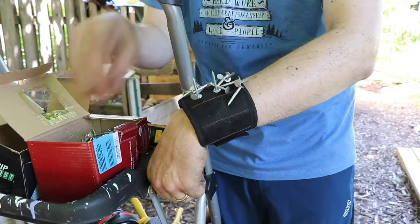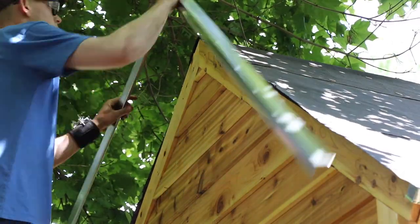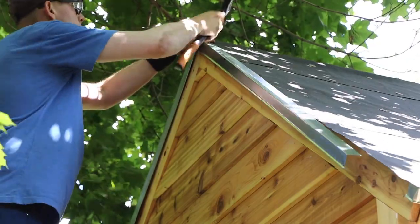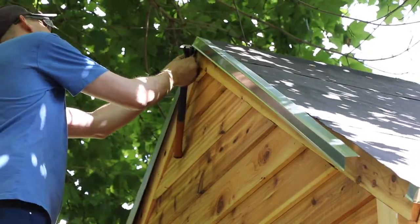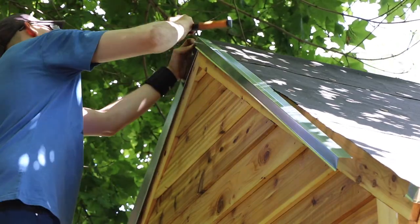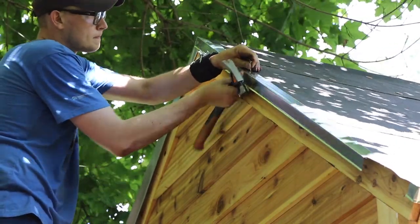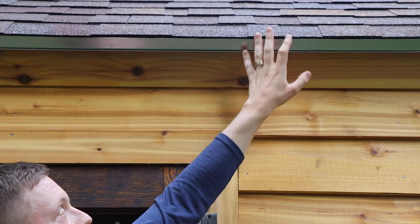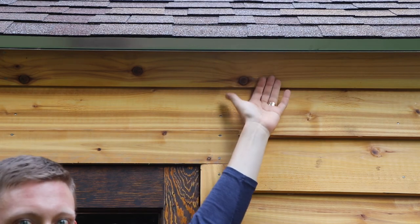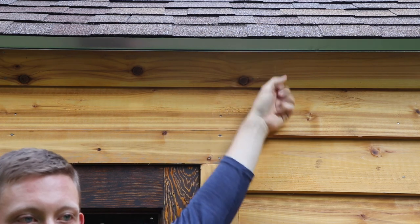This is really easy — just using roofing nails to pound it down every foot. An important thing to remember: don't put the drip edge right along the fascia. There's a lot of conflicting information out there on YouTube and websites. I opted to go with keeping the drip edge away from the fascia by at least a finger length, because with a driving rain water just shoots down fine. But with a soft rain, as it stops, surface tension pulls water in. You want space for the water to drip down and not get sucked onto the fascia and then your siding, which reduces the lifetime of both.